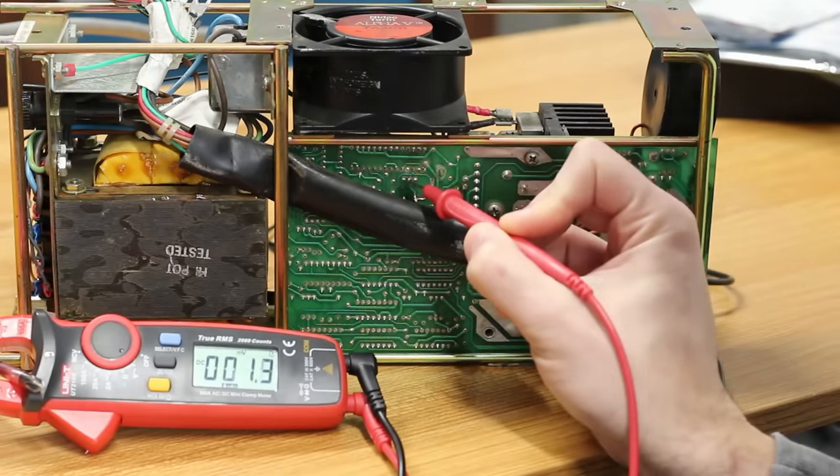We get 17300 still. Flipping the restart off, flipping the halt switch up, restart up again — yes! Look at that: 248 kilobytes of memory, 9-step memory test — 1, 2, 3, 4, 5, 6, 7, 8, 9 — total memory errors: zero. That is excellent!